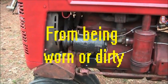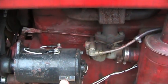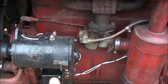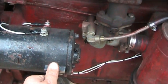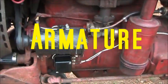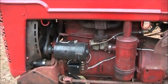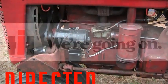If the brushes are dirty, you take this band right here off, take a piece of very light sandpaper, and clean the little copper posts — or terminals — in there. You can have somebody bump the starter to turn it while you clean them. And that's it on how to polarize your Delco Remy generator on any letter series tractor.